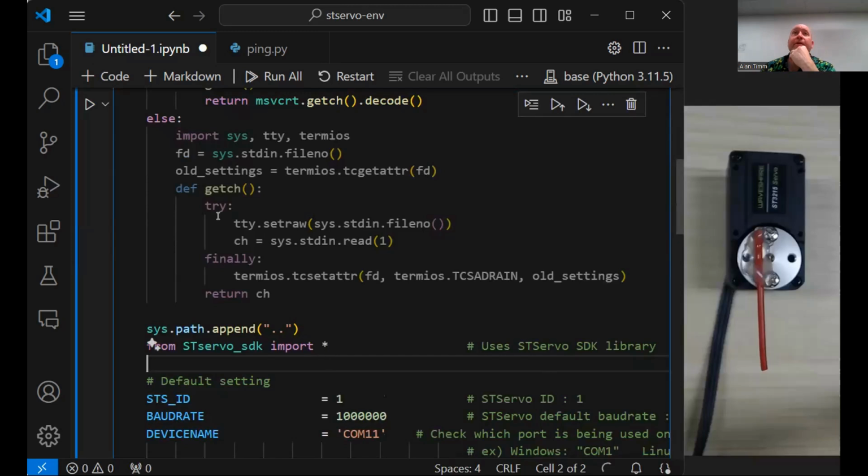This is very similar to the control method for the brushless servos for the humanoid and the dog robots. Their controllers always accept, and you can do it by velocity or force as well, but when you're communicating these, it wants to know where you want to be, how fast you want to go, and how fast you want to accelerate with every command. So you have control over how fast you want it to get there. As part of your control regime, you can take advantage of that. If I'm moving something heavy, move it at a slower speed to this position. Or in my robot's case, I'm very top heavy, so when I'm starting to move, start slowly. We use a slow acceleration so you don't topple over.